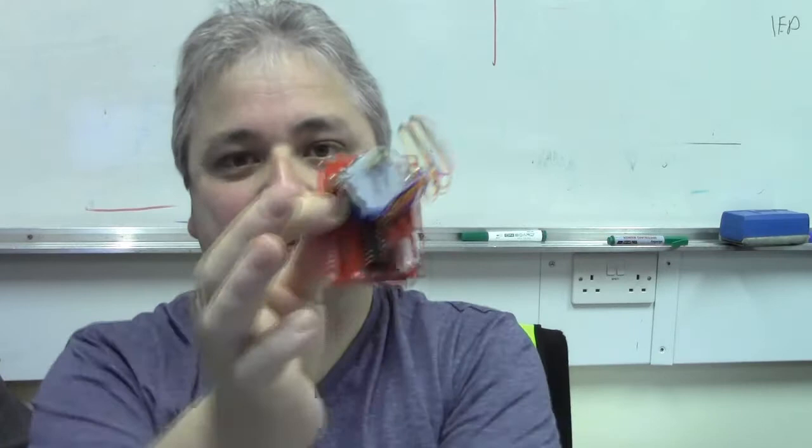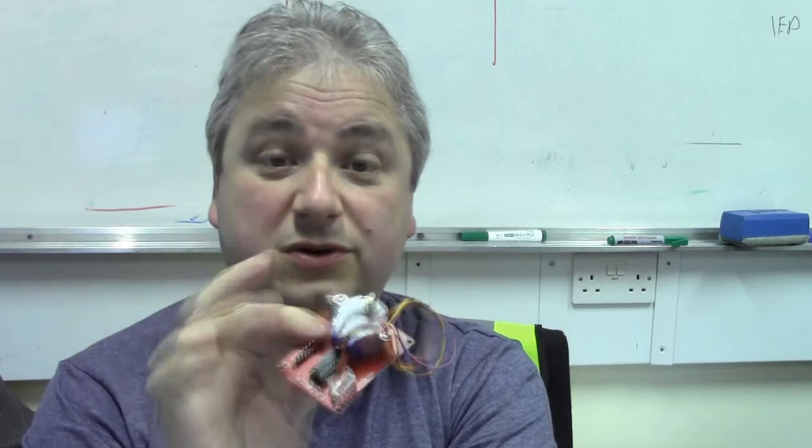As for the stepper motor, well, it's very basic. It does what it says on the tin. Single chip solution and stepper motor, good for training purposes, learning how to use them. You can strip it off the board. Don't expect much off it. There's not a huge amount of torque on this stepper, but for position control and things like that, you know, you need your motors to turn to a particular angle or whatever, your step over a set speed. Yeah, perfectly fine. And it comes with a driver chip as well, so if you want to hack it apart and pull it into your own piece of kit, you can take the motor off and the chip off perfectly fine, because the chip is in a holder. So you can recycle the bloody thing.